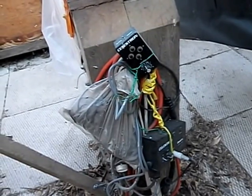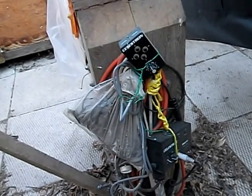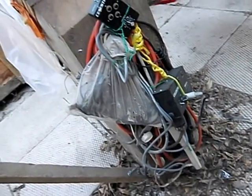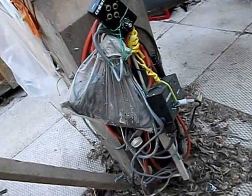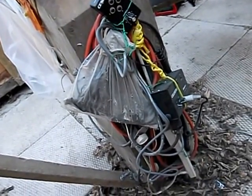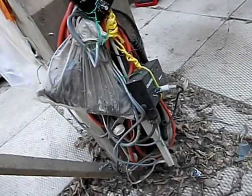That's the old-fashioned transistorized drive corrector — I don't think they even manufacture those anymore, because the clock drive is an analog motor. It doesn't use digital — it's not a stepper motor, it's just an old-fashioned motor that responds to alternating current, like you use for an electric clock — an old-fashioned electric clock off AC household current. And that down there is also part of the quartz drive corrector too.